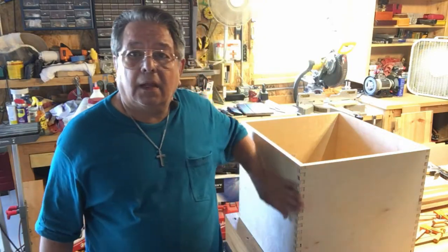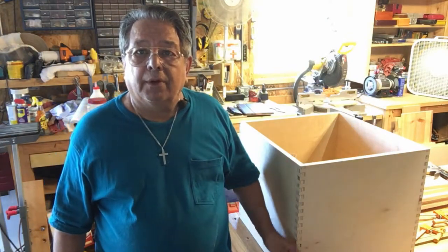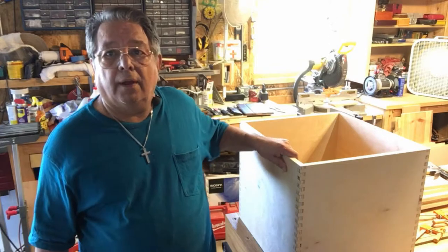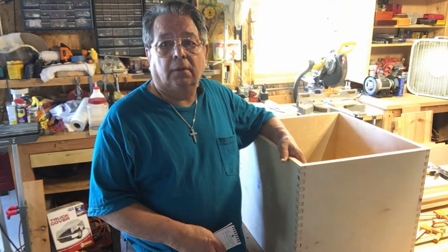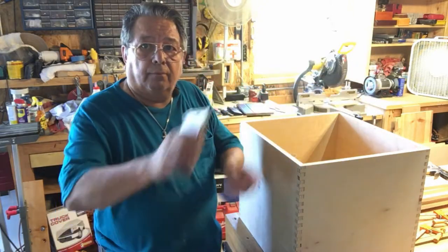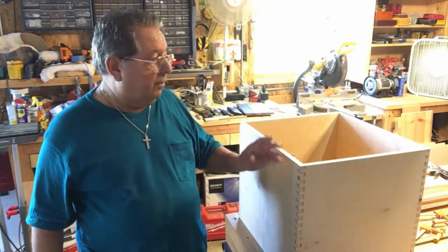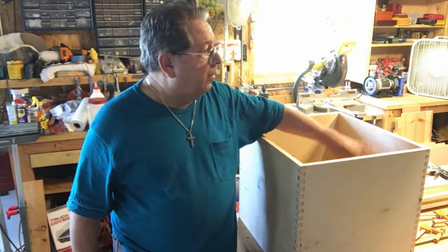That's basically it. I'm just going to finish my little sanding, and then I'm going to put some urethane on all these drawers. I'm going to mount my glide first, and my glide's already mounted in the case. I'm going to mount the glide for here first, put it upside down, and I'm just going to urethane what's exposed. I don't want urethane to get down on the glide or anything. And this one I'm going to go inside and out on all of them.